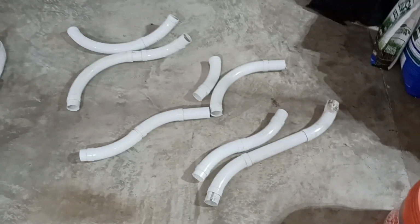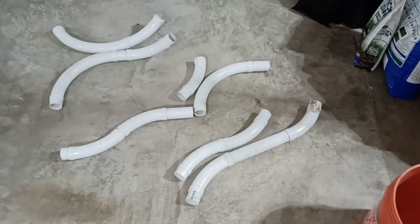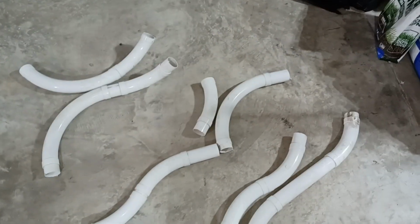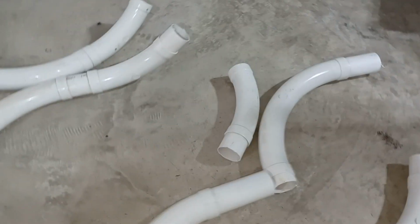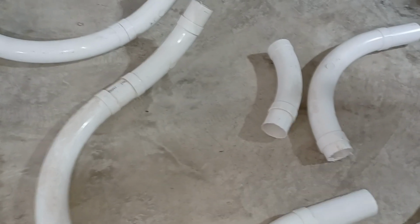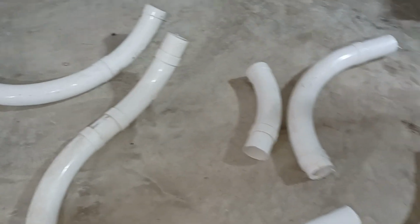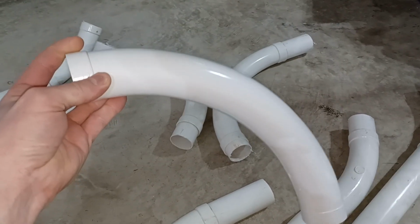So we found that the piping they had run contained all these elbows, plus a couple more. And this was just way too many for the hose to retract smoothly. Really, the best practice for a retractable raceway is that you want no more than 360 degrees of bends. And most of what you're putting in are 90s. So basically 4 of these is what you're aiming for.